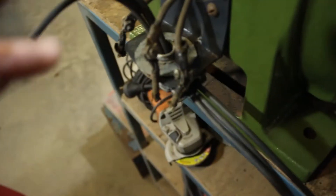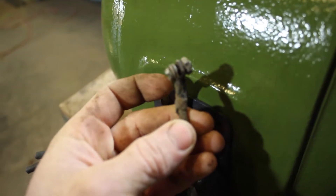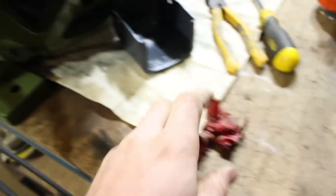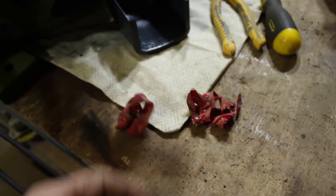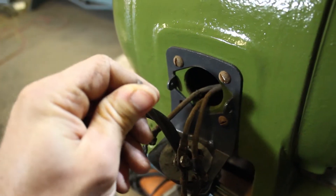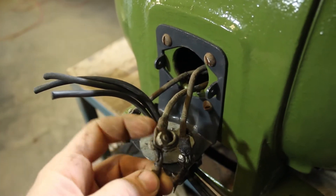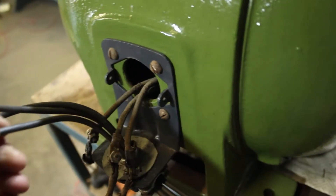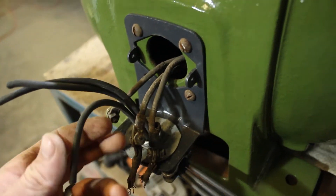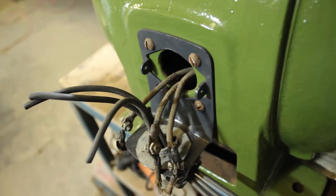The original cable connected to this motor before I pulled it out of the lathe was solid core cable connected through a bolted connection, with just some red tape over it to protect against shorts. I'll connect the new cable with a soldered splice and then put a termination end over it, which will give it better mechanical protection as well as electrical protection against shorts.